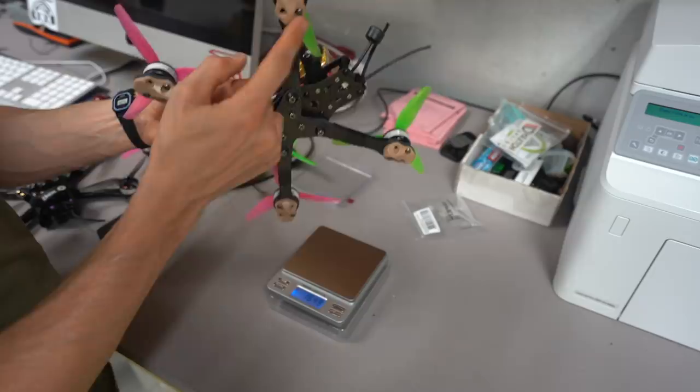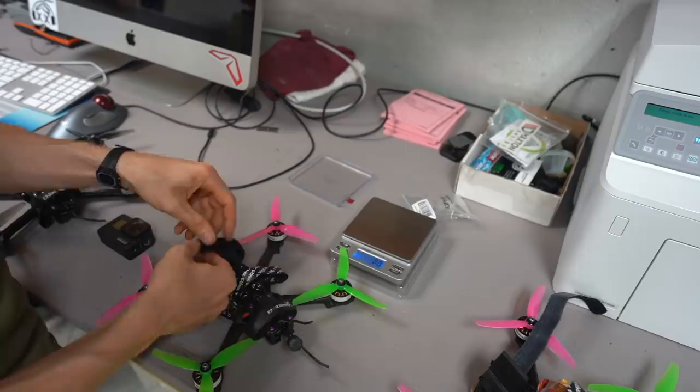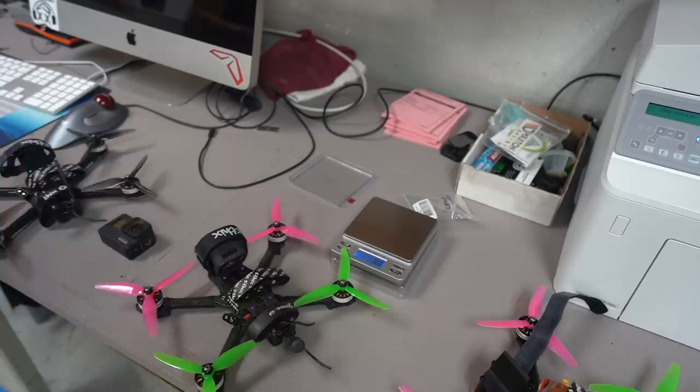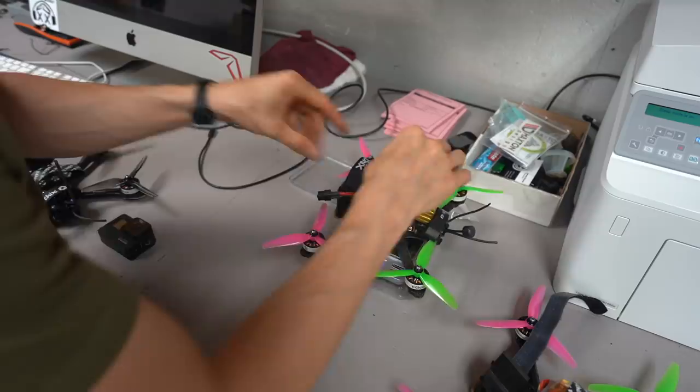If you take the steel screws off and you run it how I'm running it on my other quads, which is this quad, the super lightweight version, which doesn't have the plastics and is using the aluminum motor bolts, then we are right at 590 grams, basically 591 grams with a Session and a 1300 4S.